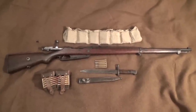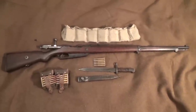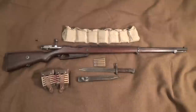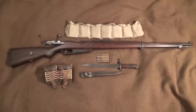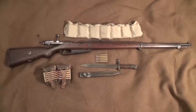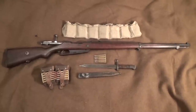It is of course chambered in 8mm, just like the German ones were — 7.92mm. Now these ones you can actually be sure without having to slug them that the bore has been opened up to .323. That's something you can't always be entirely certain of with the original German ones because they were slightly smaller bore for the old pattern cartridge, but all of these Turkish rifles had brand new barrels installed and they are all for the standard 8mm cartridge.